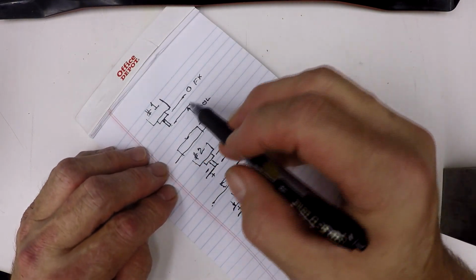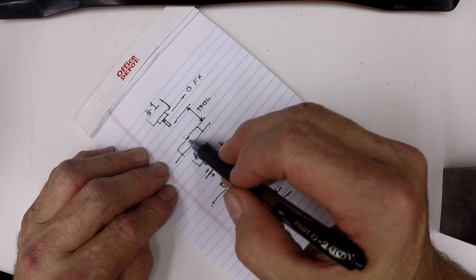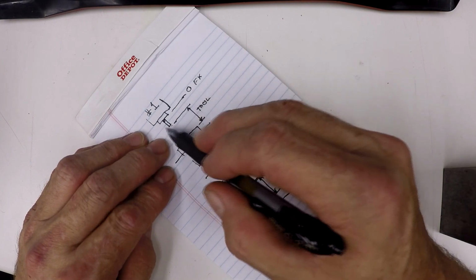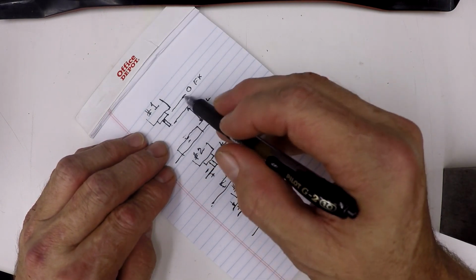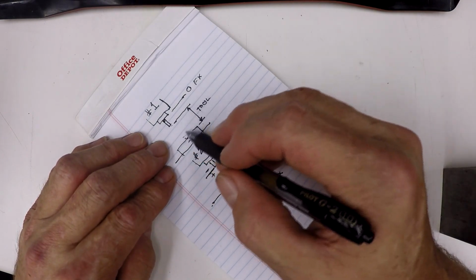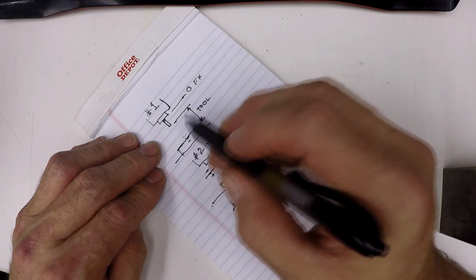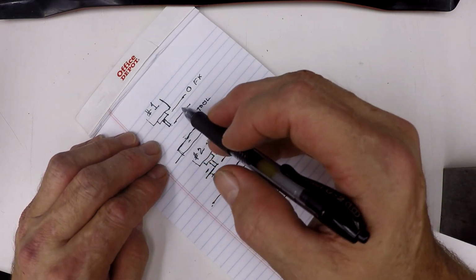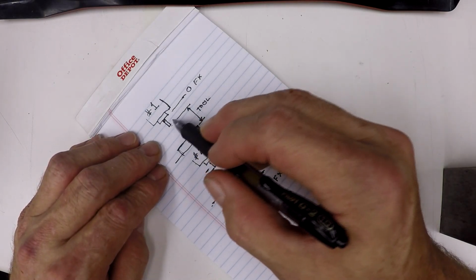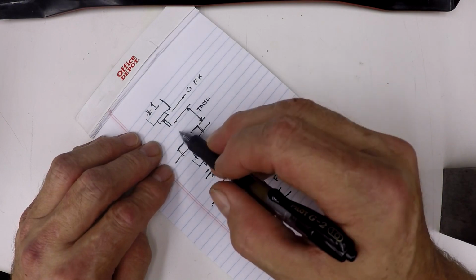The number one method has the disadvantage that if the workpiece height changes in value, let's say it's higher or lower, you have to retouch off all your tools unless you're willing to move your fixture offset up and down, but you really don't have a good way to know how much to move the fixture offset until you try to touch off one tool or something. So you end up touching off all the tools over and over again depending on the workpiece's height. This is of course assuming that you're able to use the same tools in your tool changer or whatever, and so once you touch a tool off, hopefully you wouldn't have to retouch it off or measure the length of it. But with this method you have to do it every time.